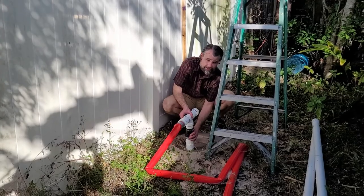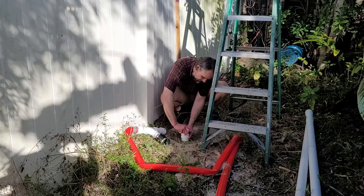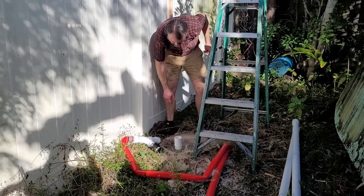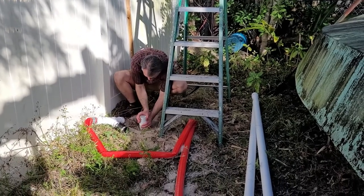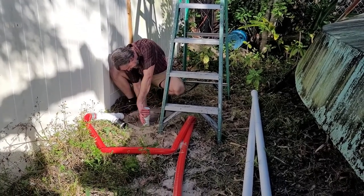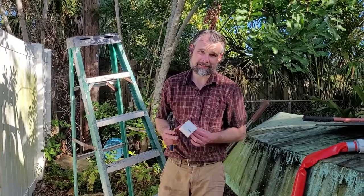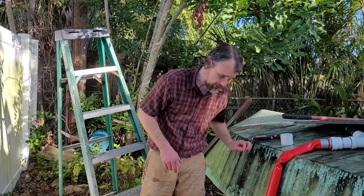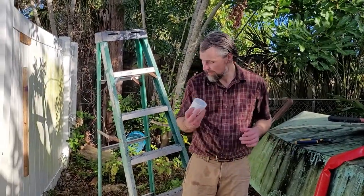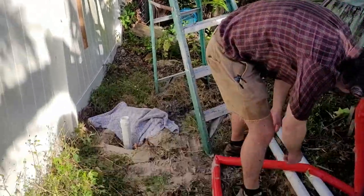So our first pipe is sunk 10 foot down. We'll take off our head. We've got a male pipe adapter on the end of this. I need my channel locks. Just a second. So don't over tighten down the joints. Just don't twist the pipes back and forth too much and it'll stay on. That was really hard to get off. But we've got this female end we're going to keep adding after we add our next piece of drill pipe.